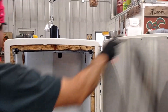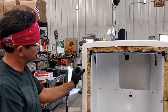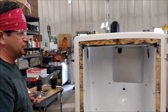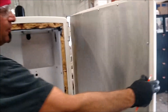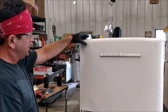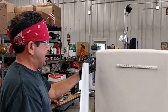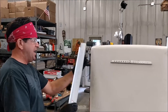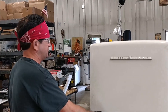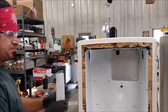The gasket will probably work out to be right around here because the stock gasket was about here. The stove-type gasketing we're going to use — we're going to put a nice piece of it all the way around on here. It'll all be almost like the same application as when it was a refrigerator, and we'll get a pretty nice seal. We don't want it airtight — it's not a submarine — but we just want a nice closure on it to hold the heat in. You will experience with these old refrigerators as you use them more that you have a lot of heat contained in here, so the inner panels might actually swell up a little bit, might contract a little bit. If there's a little bit of a gap it's not a big deal — it's going to close itself up. The metal is going to almost like condition itself to where it's going to expand and contract a little bit.